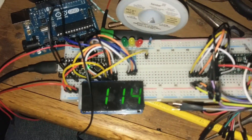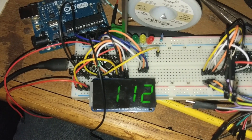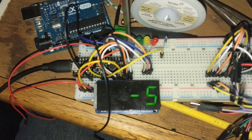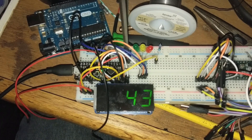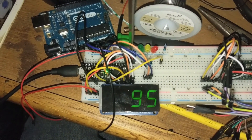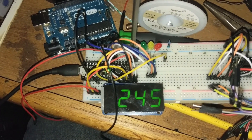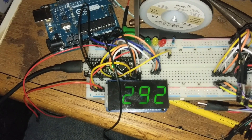Let's see what that actually looks like. If we come down and adjust the potentiometer, as we start to go down we get our negative. If I go up just a little bit it starts to glitch around. Rotating very slowly, we get a lot of adjustment. Once it crosses over the first line, around 50, the numbers go a lot slower - it takes a lot more turning. Our next crossover point is 150, and after that the numbers start to climb a lot faster. We max out at about 290. Not half bad.